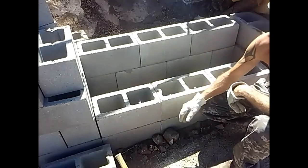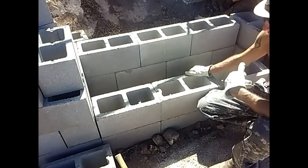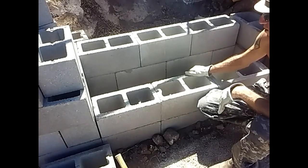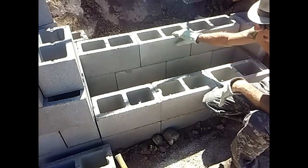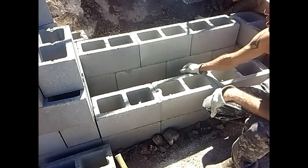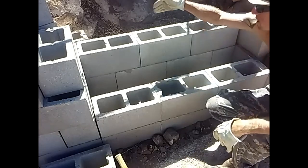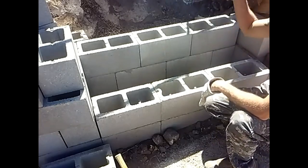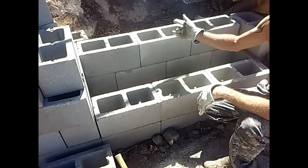What I do is fill it with rock and then do a top coat of concrete, so I've got a concrete pad. These will dry up today, and once they dry I'll fill this with rock tomorrow. Behind here I'm going to have to run a PVC pipe going into the cistern to the house, just a small section underneath the stairs.